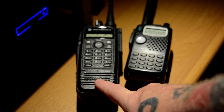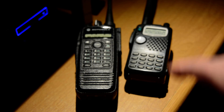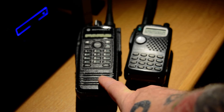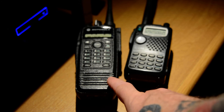I think a lot of these bands still get utilized. Sure, we use our smartphones, and smartphones are amazing — if you think about all of the things that you can do with them, it's just incredible. But we want to utilize our frequencies. 900 MHz repeaters are typically run around 927, 928, 929 MHz thereabouts, and 927.50 is the simplex FM frequency for 900 MHz. I have actually used that before, and it sounds wonderful. They also have a digital simplex frequency, and that is wonderful too.